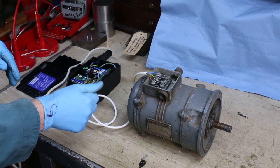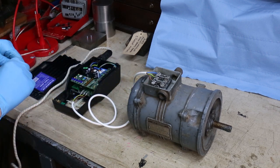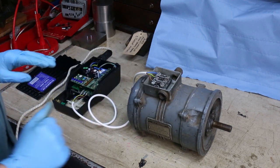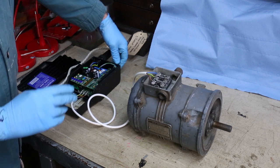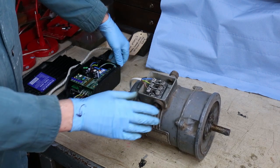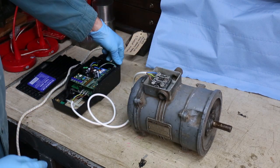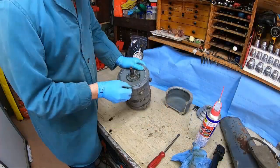If you need to change these connections at home, make sure you get the right connections and talk to somebody who knows — if you mess up the configurations you can damage your inverter or the motor. Right, we're connected up. I'm now going to switch on the mains power which will produce three-phase and hopefully our motor will burst into life. It's not going very fast at first, but one of the nice things about using an inverter is you can change the speed. I turn the knob up and the speed increases. This tops out at about 2,800 RPM. So we know our motor runs!